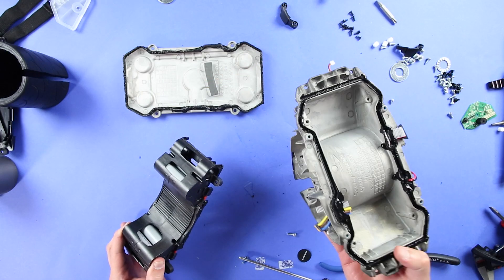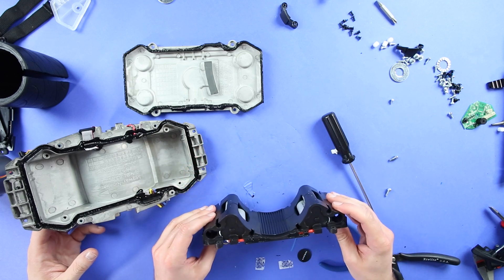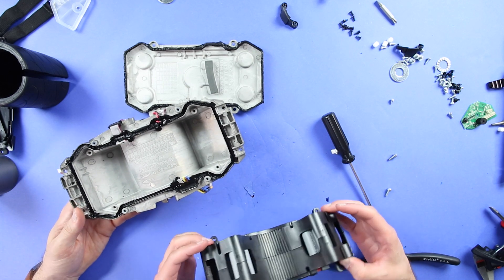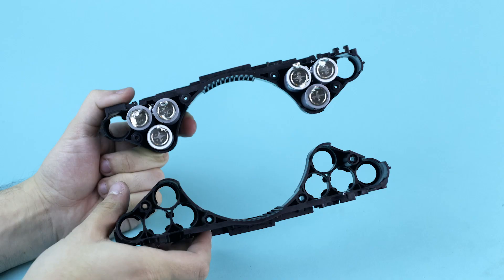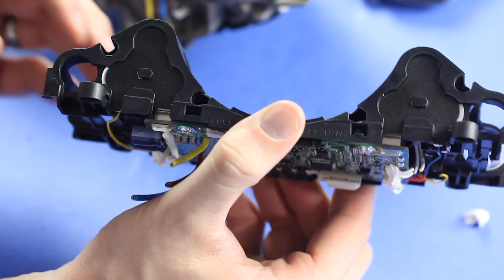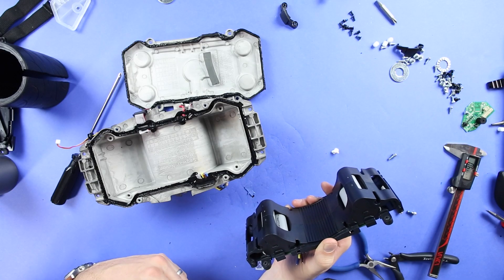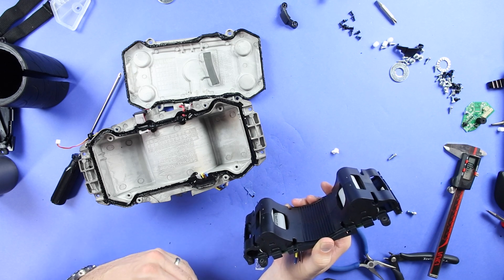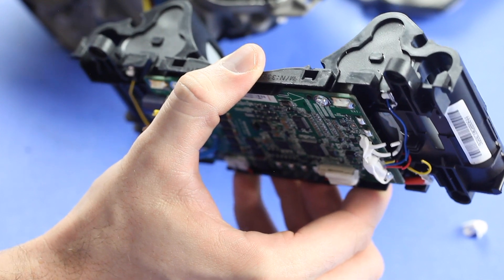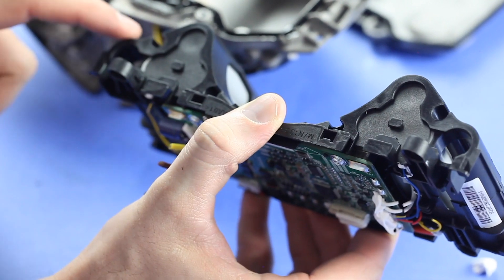Here we have the chassis, which really does weigh like nothing. They do this little triangular shape, and they use those little triangle pockets on either side of the wheel to put three lithium-ion cells each right in here. It looks like there are two slots to add an extra 18650 cell on either side of this battery chassis. That was probably done because in the early design cycles, there were so many variables — a custom motor was being designed, its resistance and voltage needs were still being worked out. They didn't want to box themselves into having only six cells. When they got their motor optimized enough, they found they did not need it, and so they did not populate those two slots with additional cells.